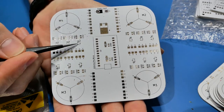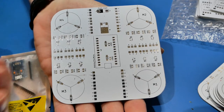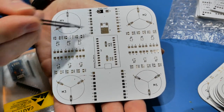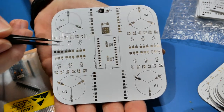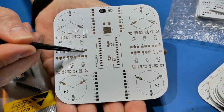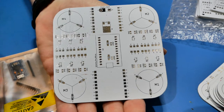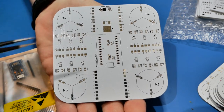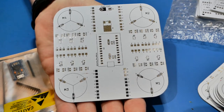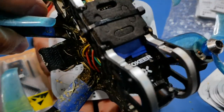The reason for this board: one, it's for SMD solder practice, so we've got NPN transistors, tiny 0805 resistors, Cree LEDs, and a lot of different pads to solder wires to. I intentionally broke some pathways so people would have to solder a wire from one point to another, because that's specifically a thing you have to do in the construction of high-speed race drones.